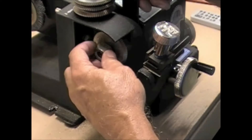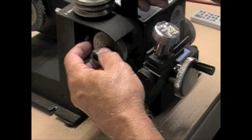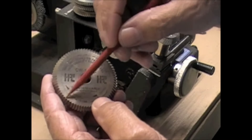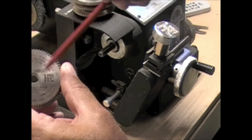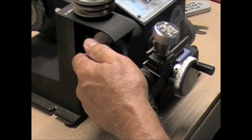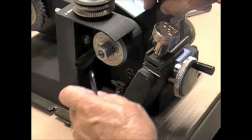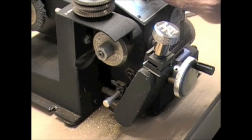There's no need to put this on too tight — if you put it on very tight, it can be difficult to get back off. Let's check and make sure we have the right cutting wheel on the machine. We're supposed to use the 14MC. You can see right here, this is the CW14MC cutting wheel. You want to make sure you put it on right — there's no writing on the back of the wheel. You want to make sure you can see the writing. There's also an arrow showing the direction it's going to turn. Remember, you're going to turn the nut counterclockwise to tighten it since it's reverse thread. Then just snug that a little bit. We have the correct card and the correct cutting wheel.